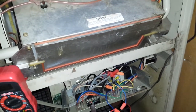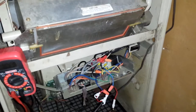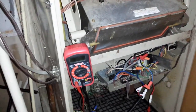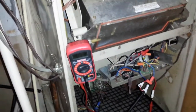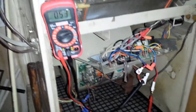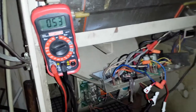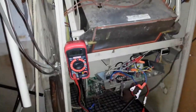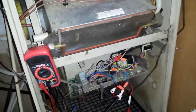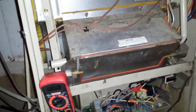Also, in the other video I find that the fuse holder is a little crappy — which OG&E's first tech put in last year — and it's a little shoddy, but that was causing a secondary short cycling. The primary reason for the short cycling is, as you can see, in just fan mode we're sucking down half an amp. It's not in heat mode, it's just fan. You can tell it's going to exceed its power relatively easily and make the thermostat short cycle.